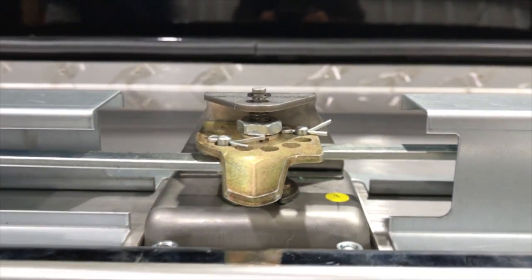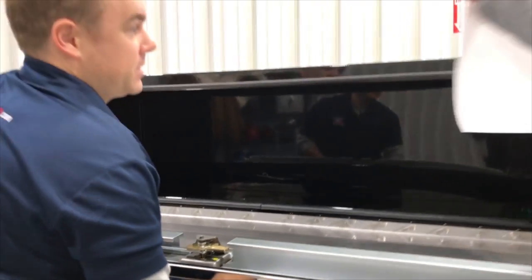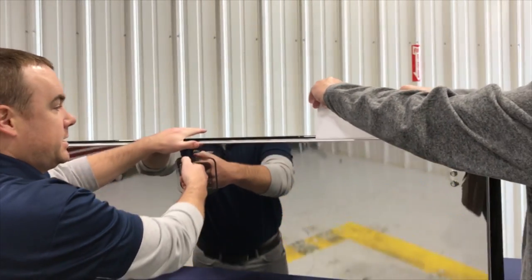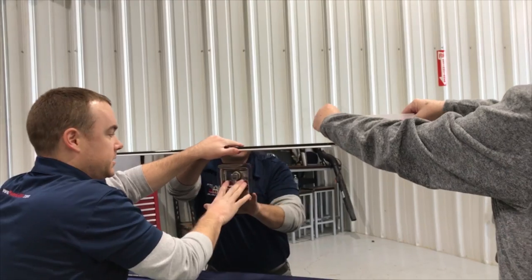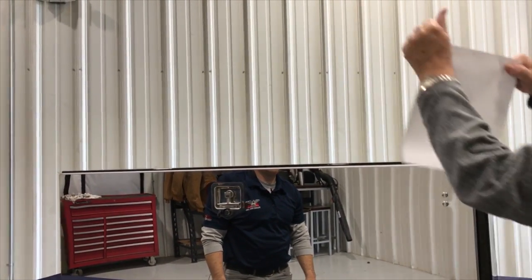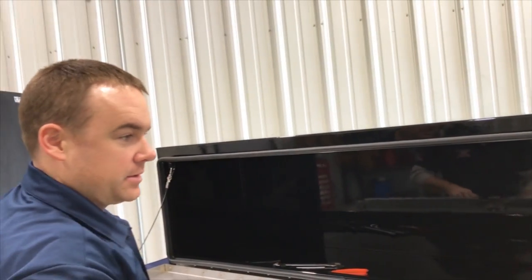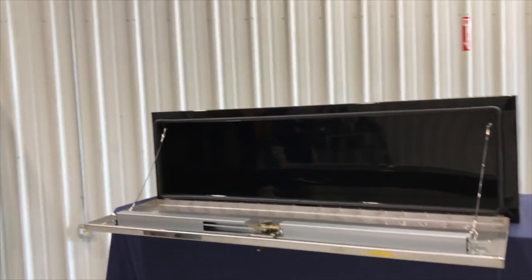That's got everything reassembled. Let's do one more hit with the paper here — this paper is a great way to gauge how tight the door is compressing that seal. Everything looks good, everything's in adjustment. No water is going to get between that door and the bulb seal.